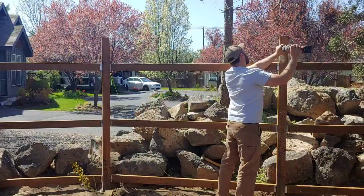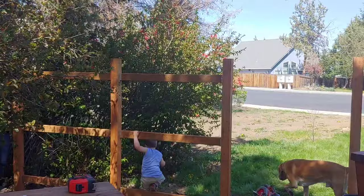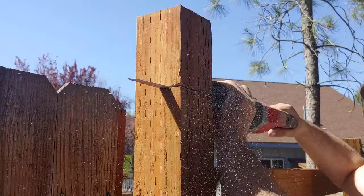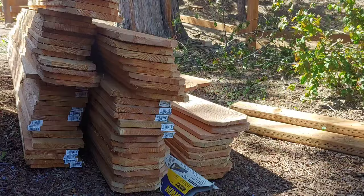You can see here our fence is coming along — there's a little bit of a slope that we had to work around in the front portion, but it all came together really nicely. Chances are your fence posts probably aren't going to be all exactly the same height when it's said and done, so you can feel free to just chop off any extra with a reciprocating saw, as we are showing you here.